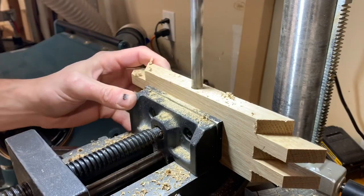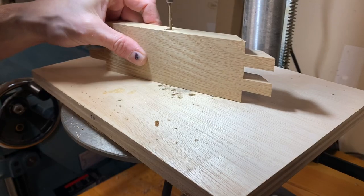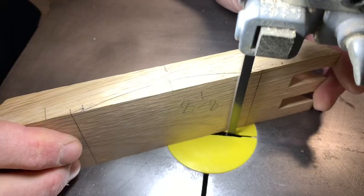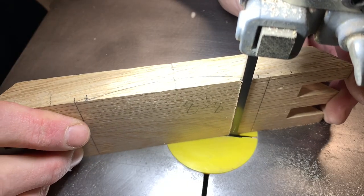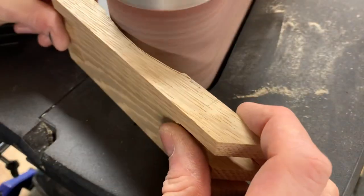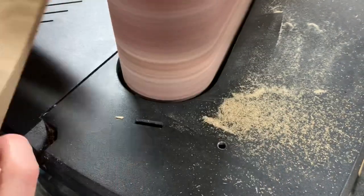The box is going to be attached to the back of the stripes with four screws. First I drilled deep wide recesses, then I put the screw holes all the way through. Due to a mis-measurement, I needed to remove a very small amount of material from the very bottom piece of the box. Without doing this, the cross piece of the lower part of the box would have been visible behind the glass.